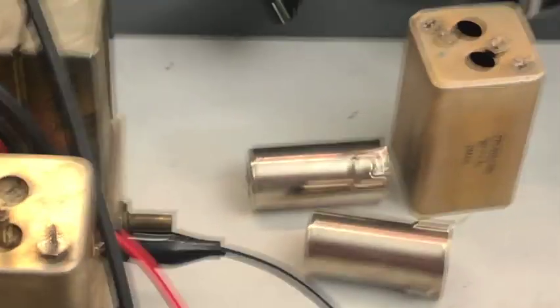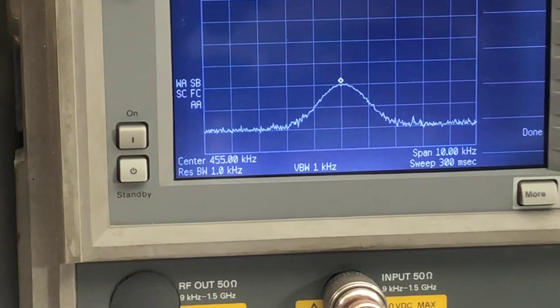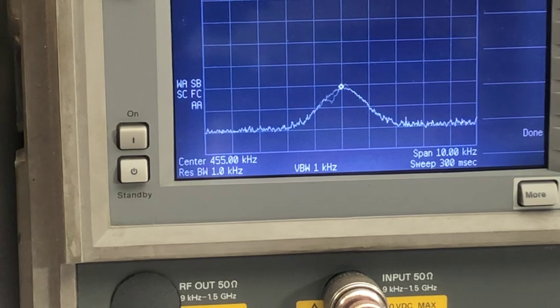At the very first stage we don't have any loss — we don't lose any signal here. So let's go to the second stage. I've moved my spectrum analyzer to the second IF amplifier pin one. I'm currently at 16 kilocycle — I'm losing just a bit. But at eight kilocycle I'm losing more, and at four kilocycle the signal disappears completely.